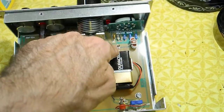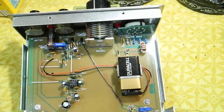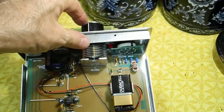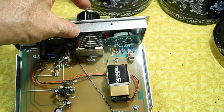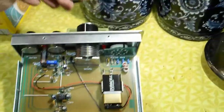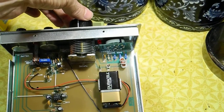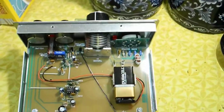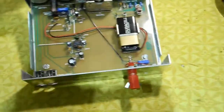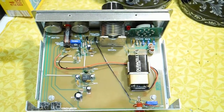I set the trimmer on my oscillator — I found it was off by a mile. What I did was tune to 40 metres and find the first station that comes in on the broadcast band just over 200. I went up to 200, came down, heard the sideband, went up a bit, and when I heard the first station I set it just at the line marked 200. It may be slightly out, but the dial is only a rough guide — you can't really see it anyway, so it doesn't really matter.